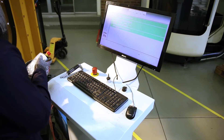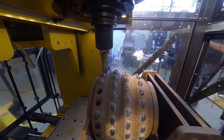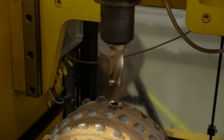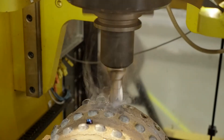Industry identified an opportunity for refurbishing high-value boring cutters which are currently discarded after sustaining damage in operation. The repair location is identified and a flat bottom cutter is used to prepare a blind parallel-sided hole.